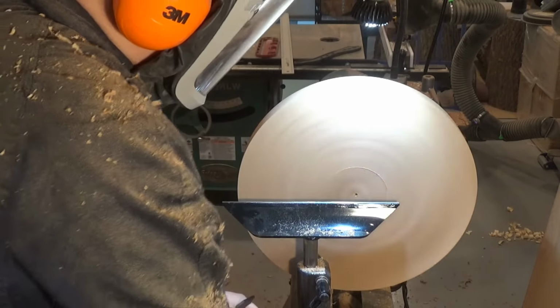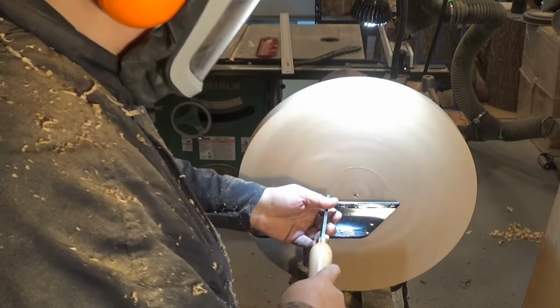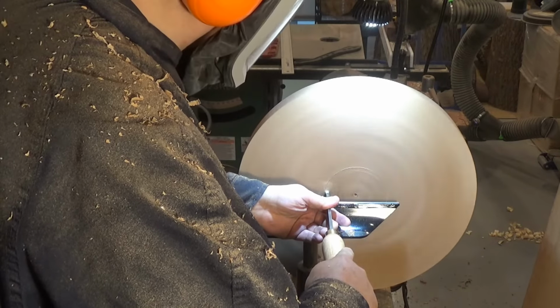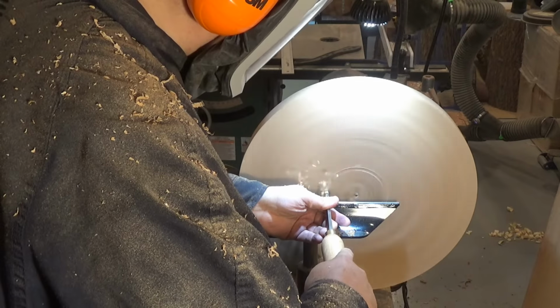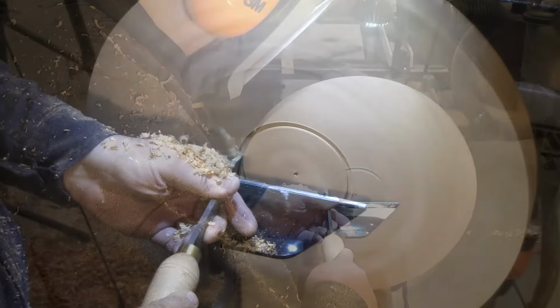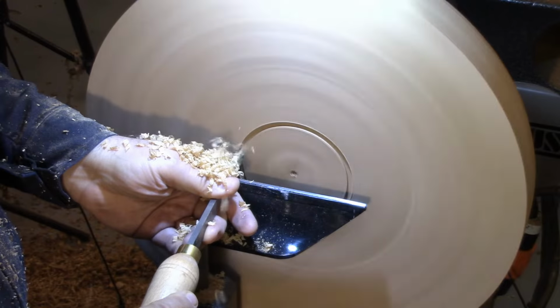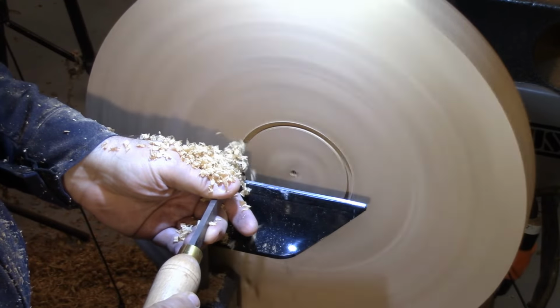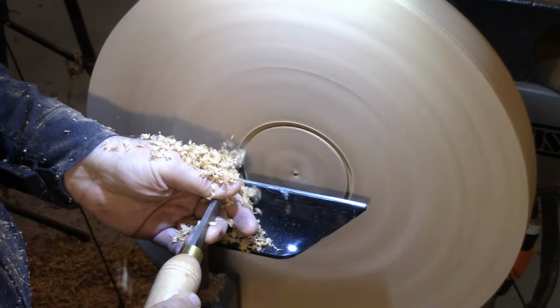I move away the tool rest a little so that the parting tool will get supported on the flat edge and not on the bevel, and I begin to form the mortise. The reason I want to do a mortise in the mouth is because I want to turn the piece around once more to work safely on the bottom and to make there a better mortise.